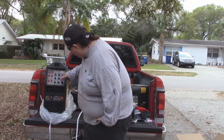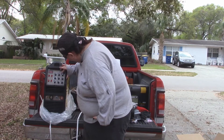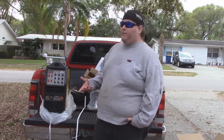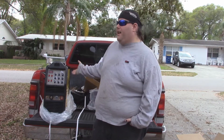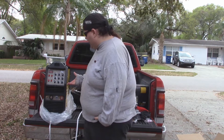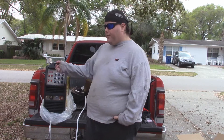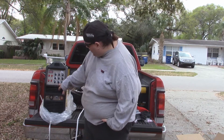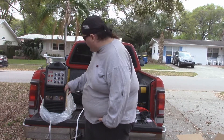I'm seeing a dial here for the foot pedal controls. Here's where I can adjust my amps - my main amps, my starting amps. Pulse - that's the other thing, this thing actually does pulse TIG, which is one of the things that sold me on it. I'm like, I can pulse with this - that's cool. This is a very inexpensive machine; I only paid like $680 for it and it's got a lot of features. It's got post flow, so that'll spray a little extra gas after I'm done with the arc. And AC balance for my cleaning action - because again, I want to work with aluminum.